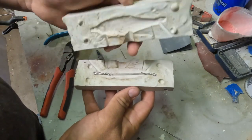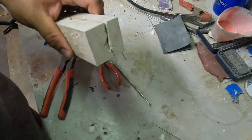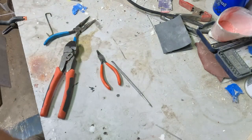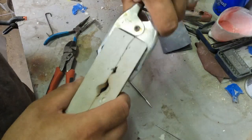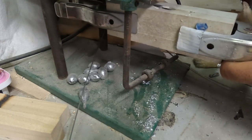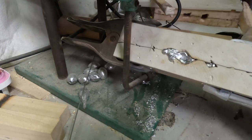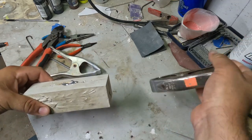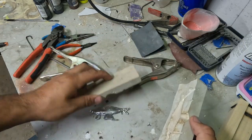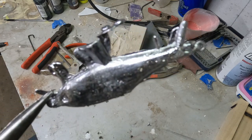You can see I've put little placement holes and bumps to orient the mold. Putting some clamps on either side. The lead is hot and ready and we're pouring. I'm shaking it a little bit just to make sure the lead gets back into those ends — sometimes the wire and the twist can kind of block it. And we're already demolding. Lead cools down and goes solid really fast. You can see it's still hot but you can demold it pretty soon.